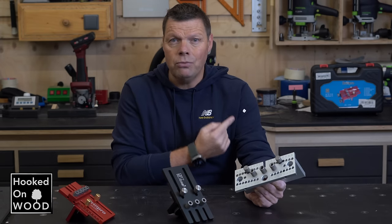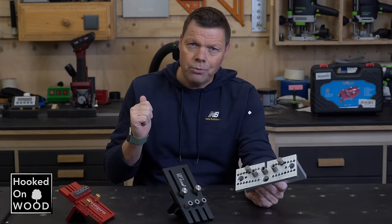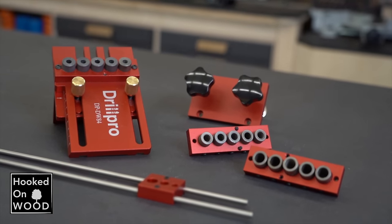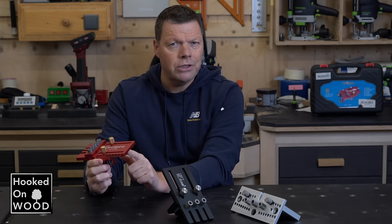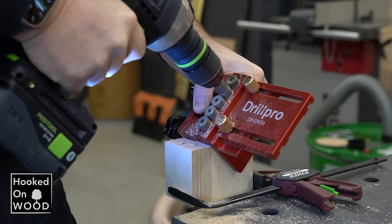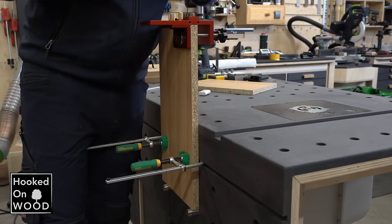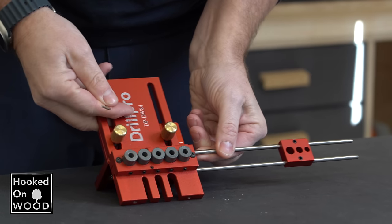I still prefer my Festool Domino because I have one and it is more flexible. But when you invest in this doweling jig and the multi-row puncher, for cabinet making it is the best alternative. On the other side, we have the Drill Pro doweling jig — it is more suitable for furniture making with five guide bushings in a row. With eight centimeters of reach, it also has a much broader range to drill holes in the center of 60-centimeter-wide pieces. It is smaller, so easier to control for multiple holes or double rows of dowels, with a resolution of one millimeter. However, the clamping mechanism is attached, and I do not see this as a benefit.